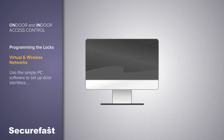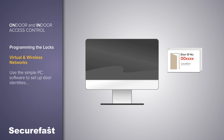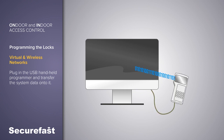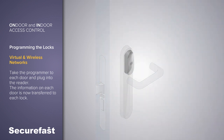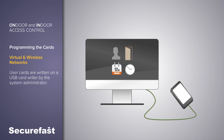Programming the virtual and network system is undertaken by the use of a simple PC software to set up the door's identities and individual users, including the date and time they're allowed to access the doors. The information is then downloaded to the locks by the use of a handheld programmer. By taking the programmer to each door and plugging it in, the information is transferred down to the lock. Once all the locks are encoded with their information, the administrator can make cards to work with each of the locks. The virtual and wireless network cards are programmed with the user ID, the doors they're allowed to enter, and the time they're allowed to access.